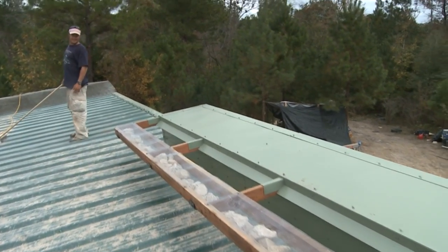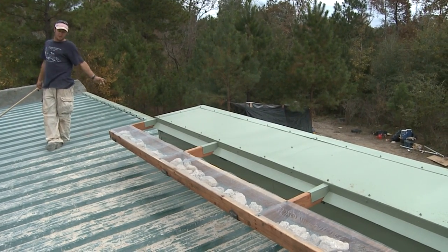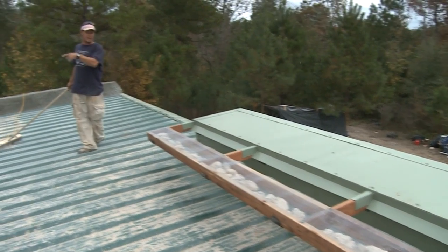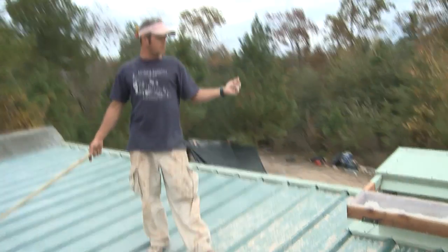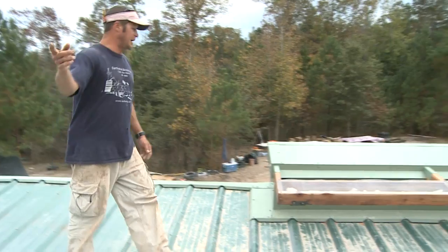These are the roof vents. On the old models we had skylights on the north side with a south slope building. But now we have a north slope building — one shot, all the water catches back there. So instead of putting skylights in, we have operable vent boxes which affect the vent tubes that are in the back of the building.